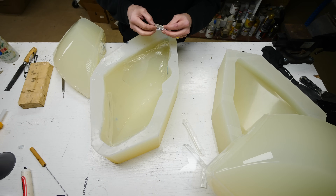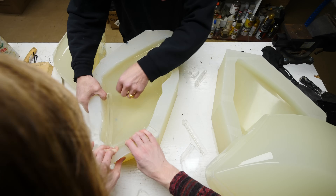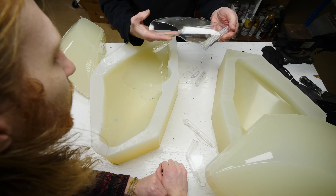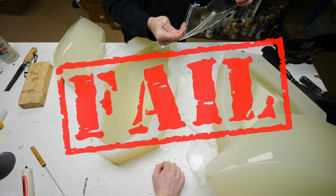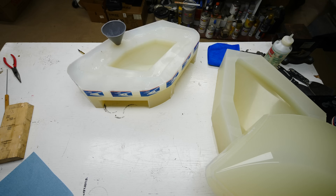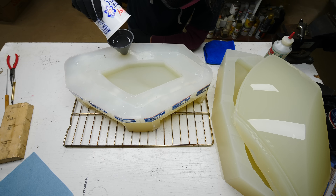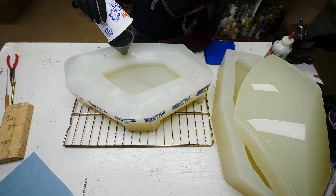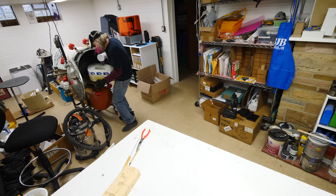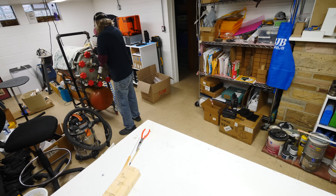You can see the flash on the sides of these parts. When we take them out with air, we actually shattered one part - a little too much air pressure and it just shattered the thing. So we have to do another one. We put the tape around, put the top part in, pour our resin in, let it come out the vent holes, and put it on a grate so we can slide it right into the tank without having to lift it. We let that cure.